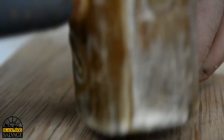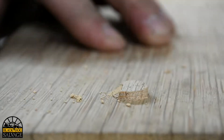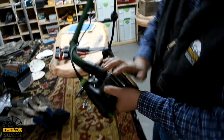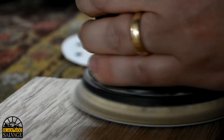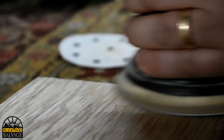You want to hammer the plug into the hole, making sure that the grain pattern is the same as the base wood. This will ensure that it basically disappears when you go to sand. Fire up the sander and sand away the top of the plug. You want to be sure to stop as soon as you see that the plug is flat with the surface.